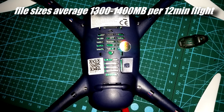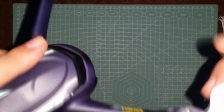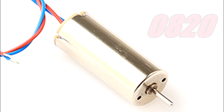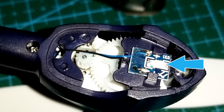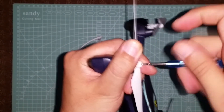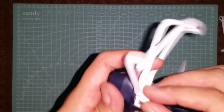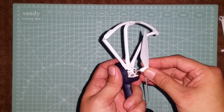I don't have the exact motor specs, but I'd imagine they are the same as the H502 series which use coreless 0820 brushed motors. The H.216 uses gears to spin the props, and you can see the LED in this shot. The 5.3 inch propellers are pre-installed and held in place by Phillips head screws. To install the prop guards, remove the propellers and simply pop the prop guards in place. Personally I don't like using them — any additional weight will impede performance and flight times.